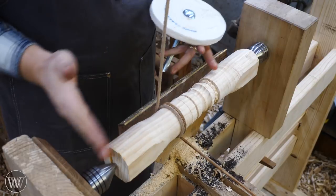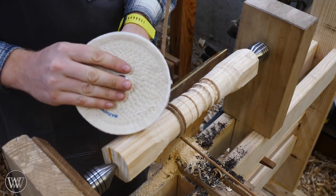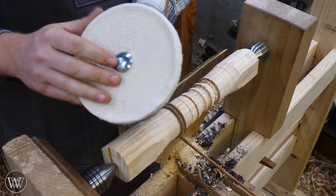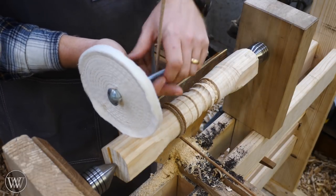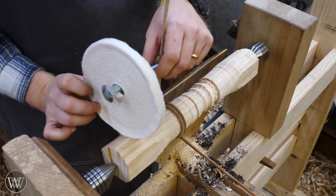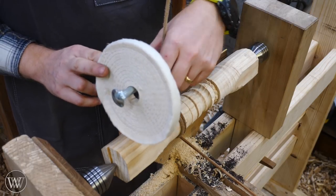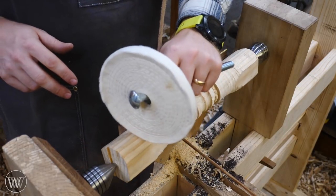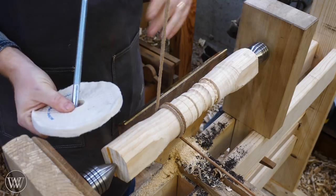One other option you could do is turn your lathe into the actual grinding tool. Just like you'd use a slow speed grinder, you could imagine this is a grinding wheel. What you could do is take your grinding wheel, put a bolt through there, sandwich it, put a small dent in here and a small dent in here, and then chuck that up between your centers. Run your rope around this and the wheel would be able to turn and grind. You'd want to reverse the rope so that when you push down on the lathe it rotates away from you, and when you pull up it rotates back towards you. So you'd put the tool on there, step on the pedal and let it grind forward, take the tool off, let it come back — and you could do the exact same thing on the lathe. A lot of people with a flywheel lathe actually have a grinding wheel attachment on the outside.